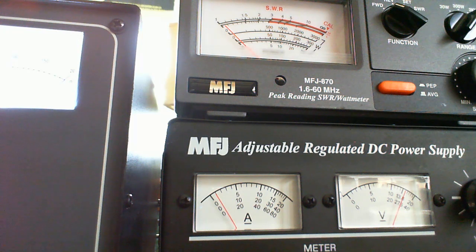That's better than with the 811A tubes. With the 811As, we were getting about 450 to 475 watts on the meter. It definitely gets more power out at less drive wattage. Of course, those 811A tubes were not new, and when they were new I probably didn't have to drive them so hard. I think this will be a good upgrade — more power out, and I'll be able to operate on the higher duty modes without worrying about having to turn down the power. I can drive at 75 watts and get the full power out.